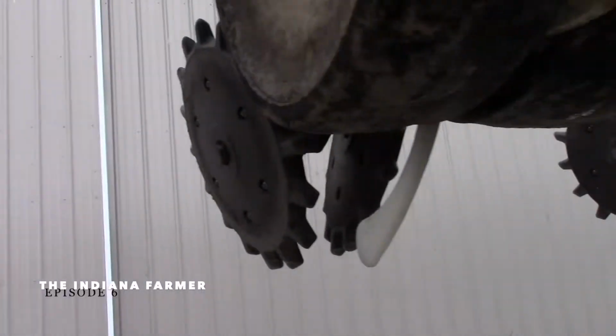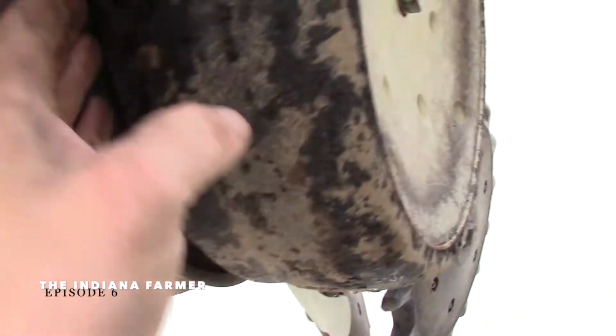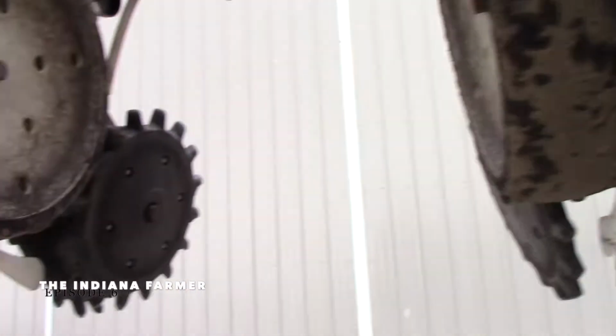The other day when I went to Owen's, one of the things he said was about the gauge wheels I asked him about. So I'm gonna show you what mine looks like. I think some of them are okay, but some of them I don't think are. Here, this one is not rubbing at all. That one is not too bad. As you can see, I can stick about my finger in here. So I'm gonna take off all these wheels.